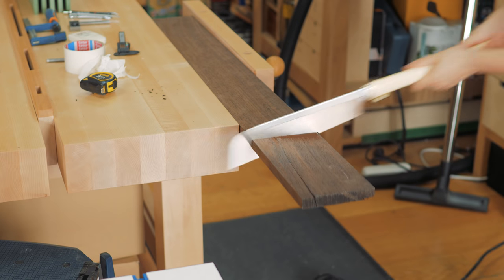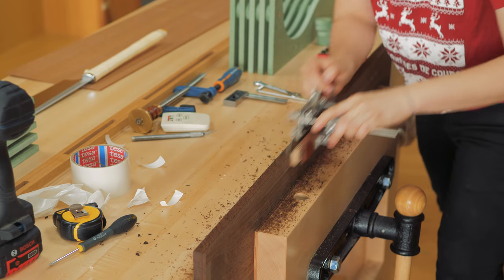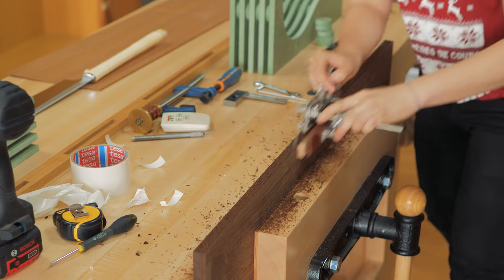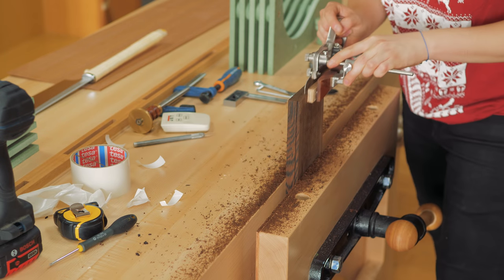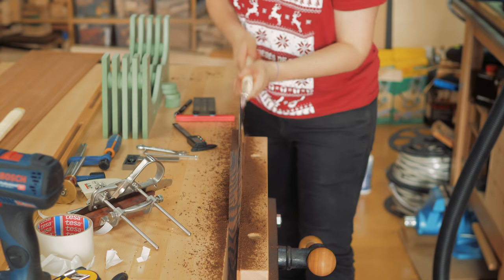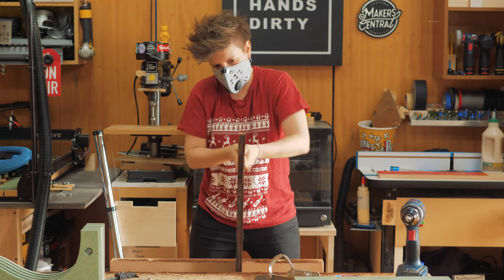So here starts the wangi saga. I thought I could resaw this board in three thin slices, but in my perfect world, wangi is not a super hard wood, so I used the plow plane to create a groove around the entire board for the handsaw to follow. It did work well, the problem was the wood being incredibly hard and taking more than 2 hours, with resting pauses in between, to cut through the material with my Ryoba saw.